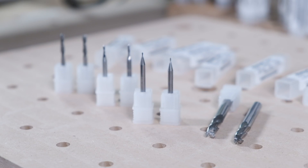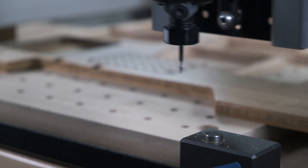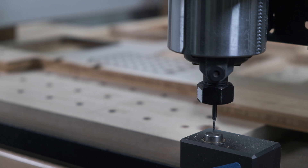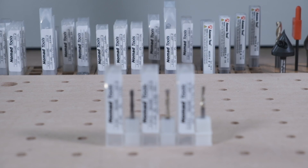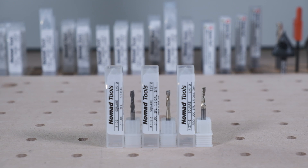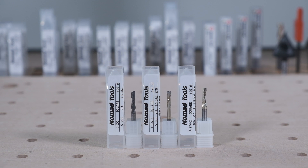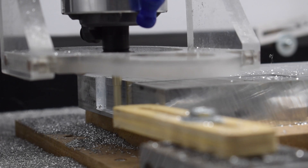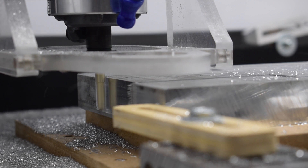Smaller end mills, especially ones with a tapered shoulder, will simply not be able to mill channels deeper than their flutes. Plain carbide upcutting end mills will work across a broad range of materials, but with a few small tweaks to geometry or coating, they can be specialized for certain applications. Our tools with a dash-Z suffix are zirconium nitride coated. This treatment helps reduce the tendency of aluminum — a relatively soft metal — from building up on the cutter. That doesn't make them impossible to clog, but it will help tip the odds in your favor.